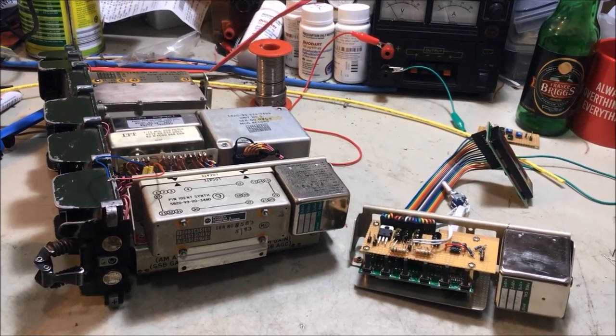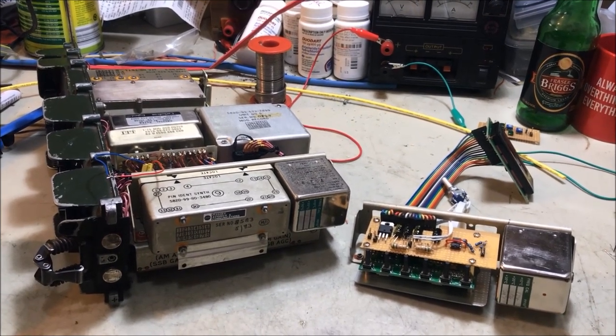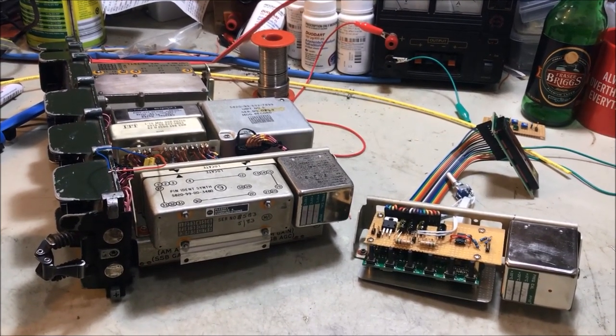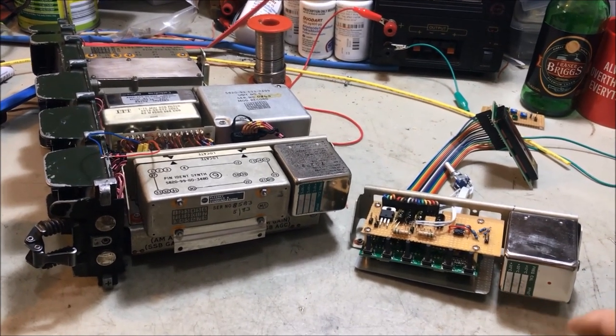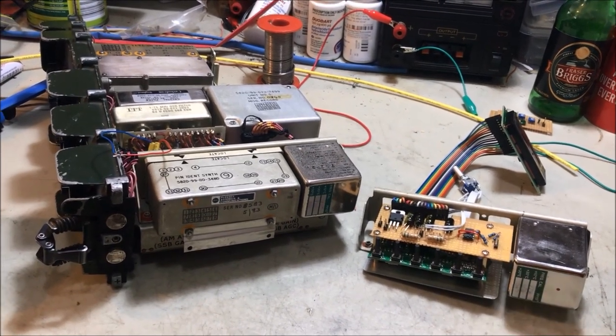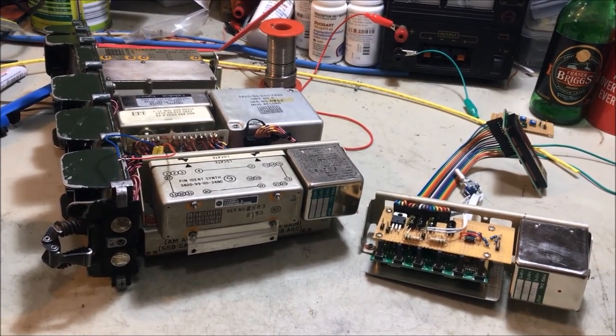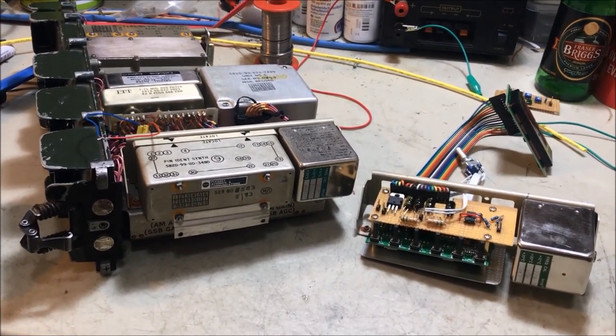But I managed to buy one of those chips separately that was already pre-programmed for the lower sideband frequency. So the second option would be to mount that chip somewhere in this area here. And I've got this area under here earmarked to do that if I want to do that. So then I'll simply put a switch on the front of the radio and I'll be able to switch between